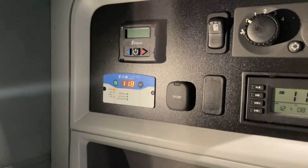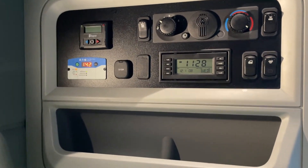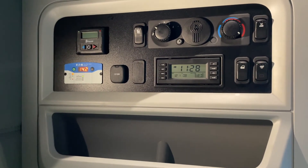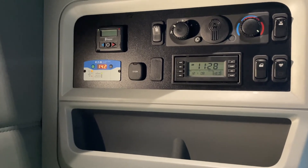You can go through and change any of these settings, but that one is the most important. Now the batteries have to drop all the way to 11.8 before the inverter cuts off. If you have good batteries, they won't get that low sitting for 10 hours overnight, so your inverter will stay on all night. Hope that helps!